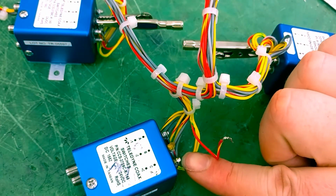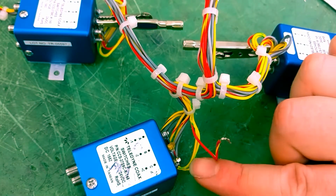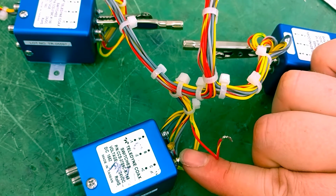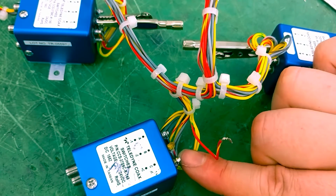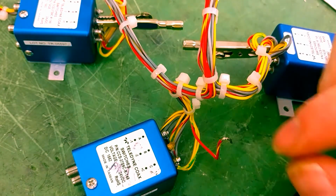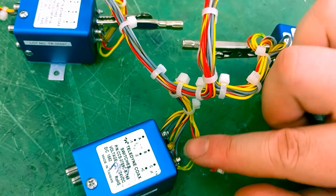Because when you're soldering, you have to first transfer the heat, and that heat could take a while to build up, right? So as soon as that solder gets to that melting point, that lead-based solder, you will be right at the temperature at which this SN63 solder is going to melt. You've got 5 seconds from that point to take off what you're working on, and you have to remove the heat from there.